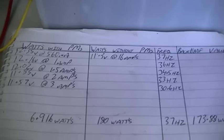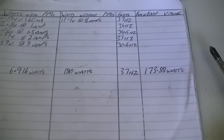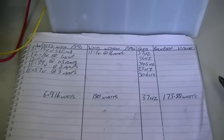So the permanent magnets have an extreme effect on the current that motor draws. We knew the magnets affect the amount of current a motor draws, but who would have thought it was that much? 180 watts of power being drawn without the magnets, 6.916 watts of power being drawn with the magnets — a difference of 173.88 watts, which is our back EMF value. For a quick, not-so-accurate test, it is within the ballpark of what we can do here. Thanks for watching, guys — now we know the difference having the magnets in place makes to the amount of power that motor draws. We'll see you next video.